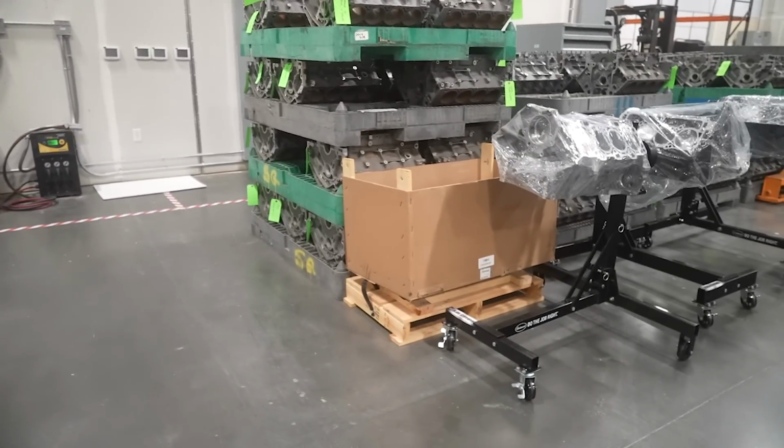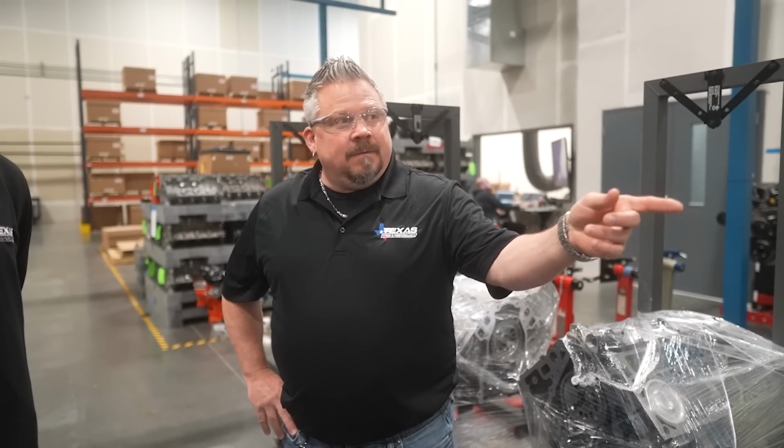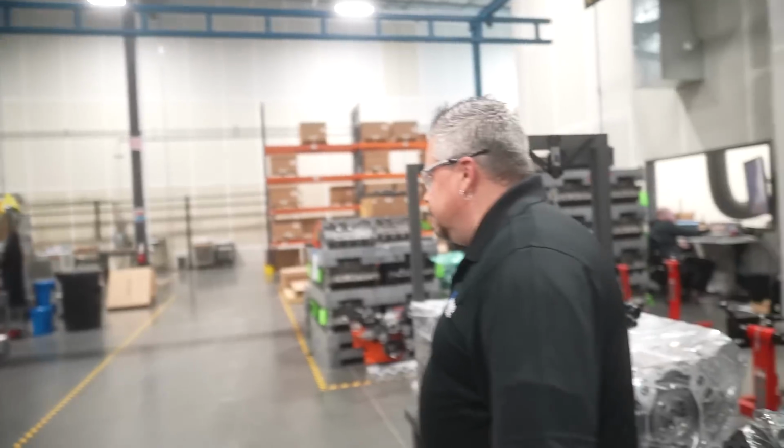So one more question on that 426. What is all inside of that as far as what parts do you guys use to get the 426 displacement, pistons, rods? Right now that's a stock bore, but it's got forged pistons, forged rods. I believe it has stock crank in it. Okay, so stock crank. Actually, no, it doesn't. That Hemi has our forged crank. Yeah, it's a TSP forged crank for Hemi. Wow. So when we come out, we'll have a TSP forged crank, TSP connecting rods, and then we'll likely go with either the Wiseco or potentially a CP Texas Speed piston. Awesome. That's really good to hear.